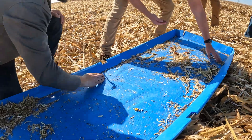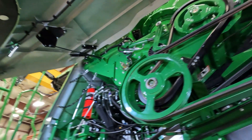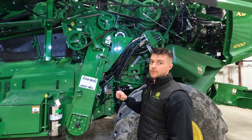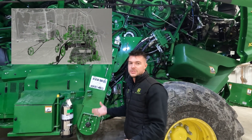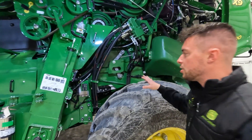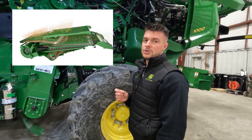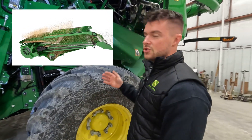While we're underneath here, you're going to see a lot of belts. Why is that different? We've switched a lot of chains and other drive accessories over to belt drive, because belts draw less horsepower — that plays into the whole efficiency part of this machine. On our cleaning shoe, we bumped up capacity 36% over our S Series Combines — that's 75 square feet total of cleaning area. It's the industry's largest, and that allows us to really get a good grain sample.